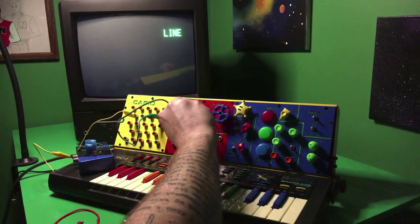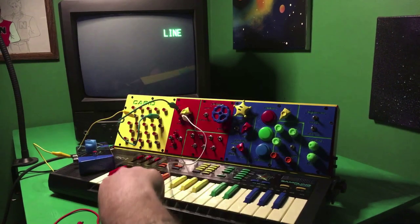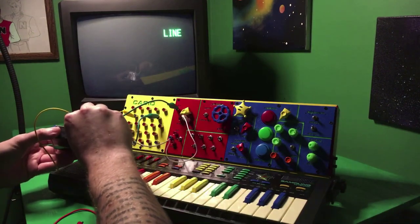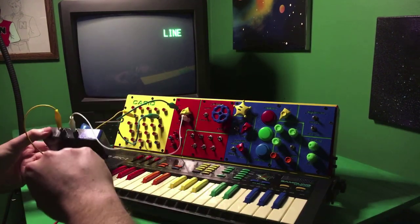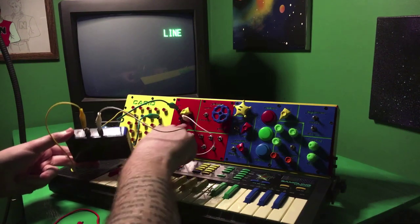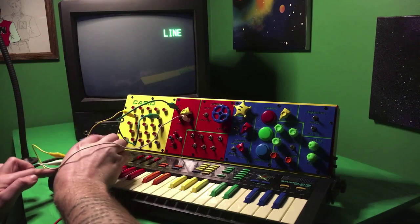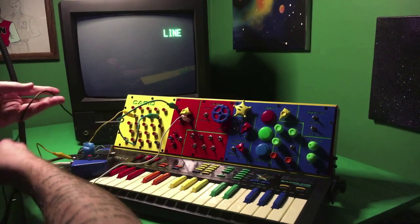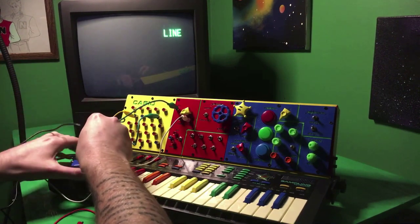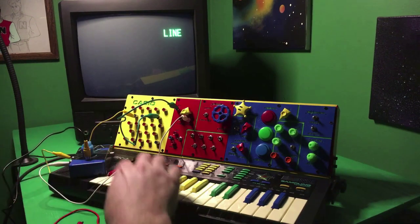Then we're going to take output B, we'll dial it in slow. And I'm going to wire the output from the control pot into our converter jack. So again, ground to the outside, and then output to the inside, which is the outside of the second jack. Then finally, I'm just going to connect the TV output to this red output jack so that we can see what's coming through.